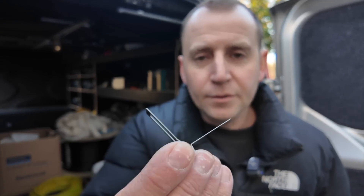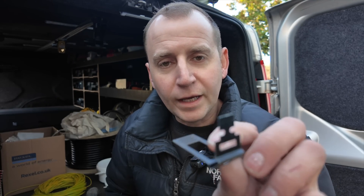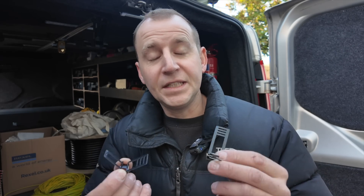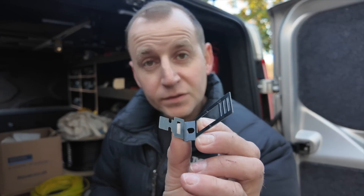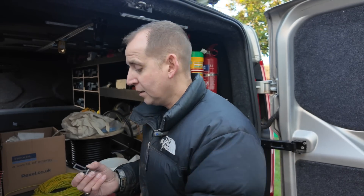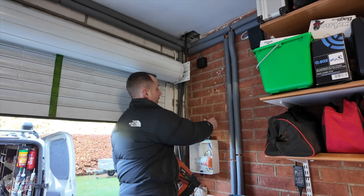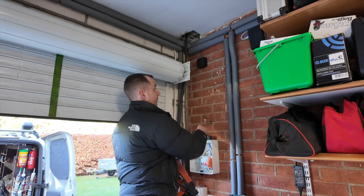There are these ones here which look like that, and there's these ones that look like that. Both of them are fine for the 6mm EV Ultra, but if you're pulling in a 10mm, these ones won't fit and these ones do just about - you'll have to go through the last notch. So my advice: if you're looking for D-line clips, go for these ones. And you do get an absolutely solid fixing with that in the mortar.